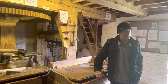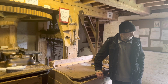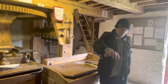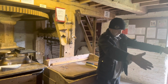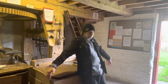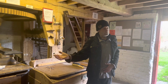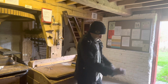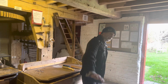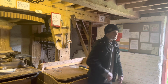Yeah, we had a thing a few years back, we had a bit of a leak and we dropped down there. The mill manager found some records going back to the early 60s when they first took over, with a picture of the bank at the back, all brown in the summer, apart from about a metre wide strip that started a metre wide and came down and got 2 or 3 metres towards the bottom where it was lovely green grass. So they realised there must be some leak, so they emptied the mill pond and found that there was a breach. But all they did was just fill sacks with bricks and old bits of rubble, throw them in the hole and then put a thin smear of clay over the top. Well, years later that clay had gone and it was just seeping through the rubble.